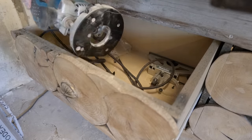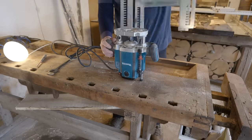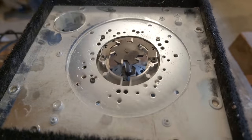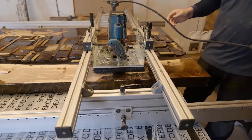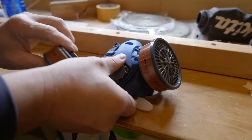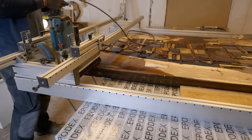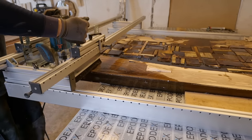My floor is curing and the pallet blocks river table has also cured, so it is finally time to flatten it. I'm using a thing called a slab matrix - it's basically an XY slider that allows my router to slide around at the same level over a large surface. I'm using a huge flattening bit and I also remember to put new filters on my face mask - this type filters out even the smallest particles. Flattening with a router is really dirty work, but it is also here that the look of the table will be revealed finally.